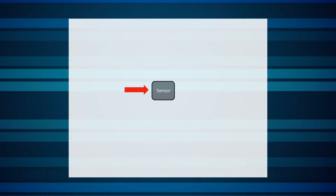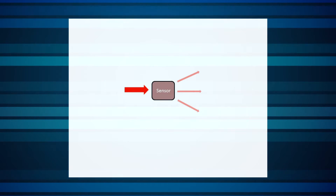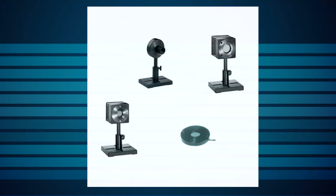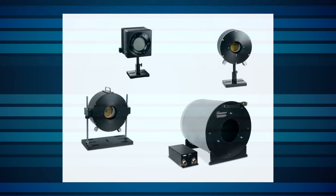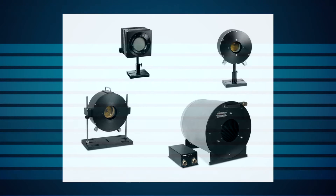For measuring high average power beams, you need to use a high average power sensor, right? Let's explain that question. As laser power continues to enter the sensor, the resulting heat has to get removed at least as fast as it keeps coming in, otherwise the sensor can overheat and fail. While sensors for measuring a few watts can use conduction, higher power sensors typically use fan or water cooling. Sensors designed for working at multi-kilowatt levels tend to be large and heavy — that's just part of how they manage to dissipate heat at such high rates.